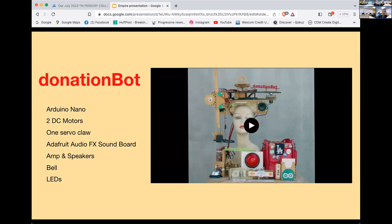Yeah. Well, this is quite sophisticated for me. I'm self-taught as far as the programming, so this took a long time to program. And then it's got limit switches. Even if it's simple, it just adds a lot of wire. It's got an up limit switch, a down limit switch, and left and right. This is a lazy Susan up here with a gear on it. It rotates.